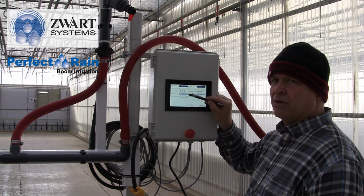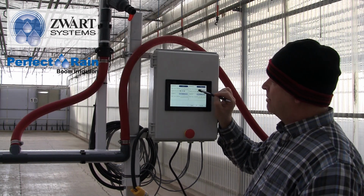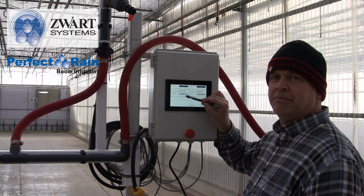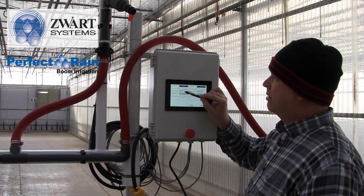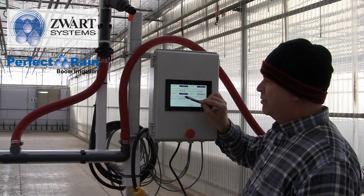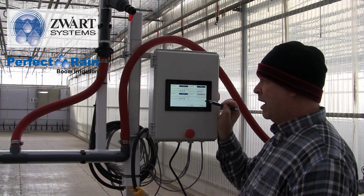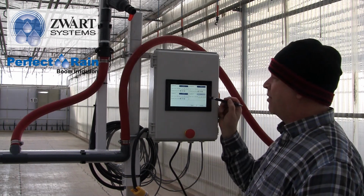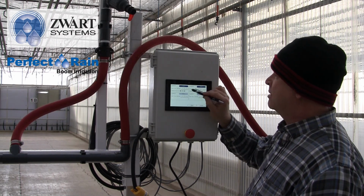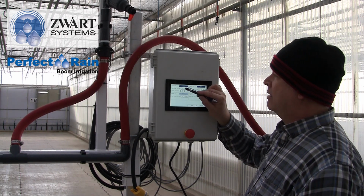And if we don't initiate the water toggle, so that is on, that is off, then that time, it'll do 55 minutes until it runs into 6 p.m. and it'll stop. That boom will sit quiet until tomorrow morning 6 a.m. If I turn on the water and give it a value, then it will start again and do something different until cycle D starts. Then it'll be quiet. So I could water into early evening and not through the middle of the night. As soon as I turn that off, this A cycle begins, B takes over, it stops at C, stays quiet until the next morning, A.